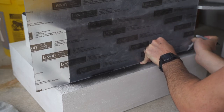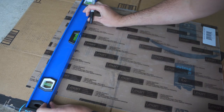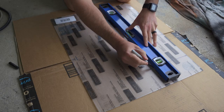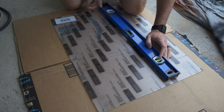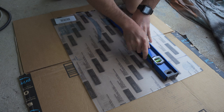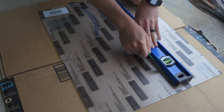Next, I place my plexiglass type material over the window and mark out where I'll need to make my cuts. Using a straight edge and a glass cutter, I then slowly cut away at the plexiglass material in order to make my cut. This step does require a little bit of patience as you'll want to cut away at the material slowly and with shallow, even passes.